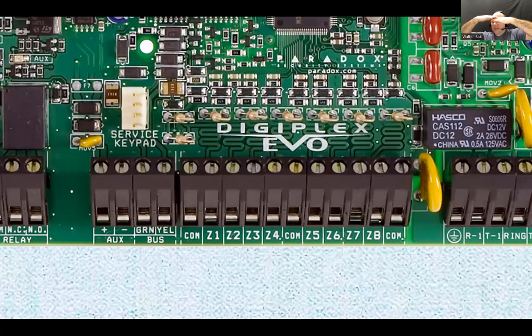So it's like this here. It looks like a reed, just like the reed in a saxophone mouthpiece that vibrates when you pass air through it. So that's what it looks like, and that's why it's called a reed switch. When you get a magnet close to it, the switch closes. When you remove the magnet, the switch opens.